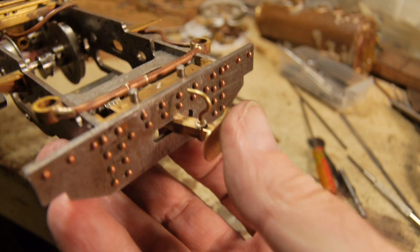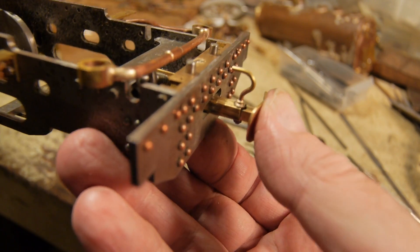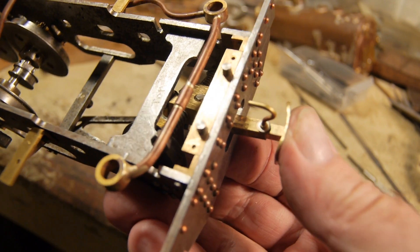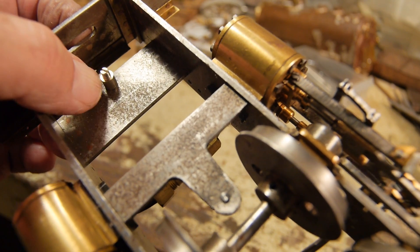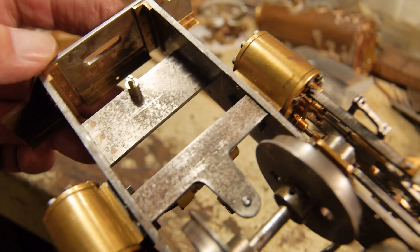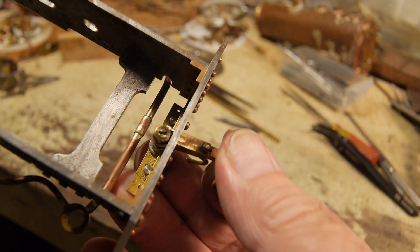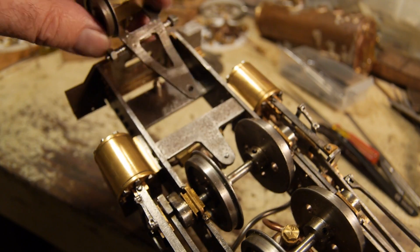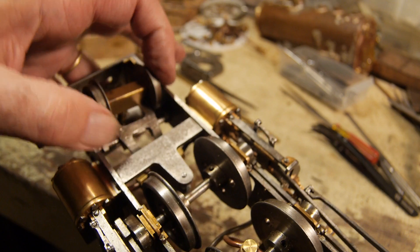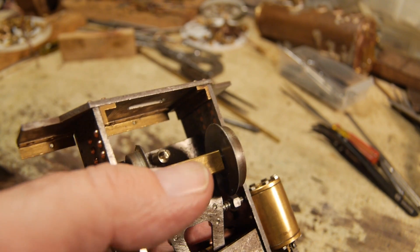This is my method of making a spring-loaded buffer from raw materials. You can see the hook for putting the chain onto, and you can see it's spring-loaded. At the front it's much more a standard position. You can see the pin there and the slot — that's where the shank of the buffer is going to lie. This gives me a bit more length than at the back, because I've got more clearance at the front from the front bogie, and you can see that the pin is clear when I place the front bogie in.